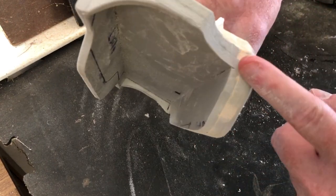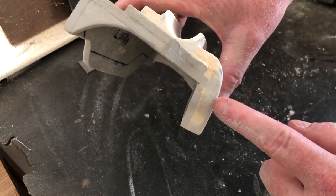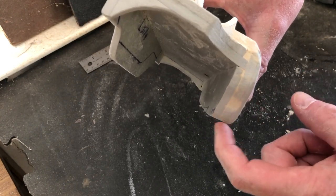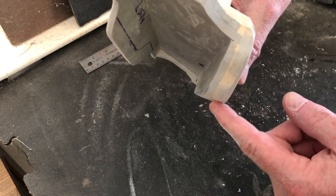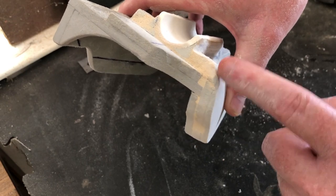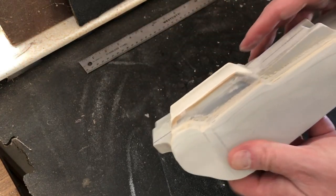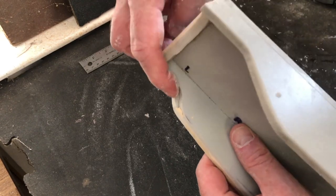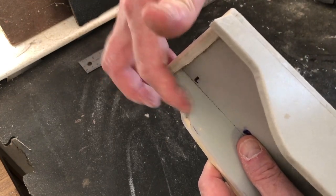As you can see I've actually removed quite a bit of material here. I went to the top and there's barely any of that - we have the original quarter inch thick piece, then we have the first quarter inch piece of the half inch we added on, and there's just not that much of that especially at the top here. Left maybe an eighth to a sixteenth of an inch in there. I've removed plenty of that. Let's go ahead and hopefully you won't have to deal with this but let me real quickly remove this so that they line up.